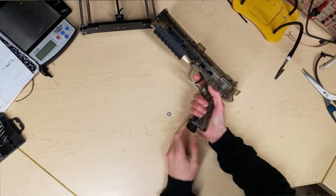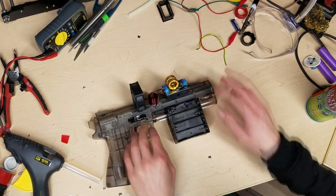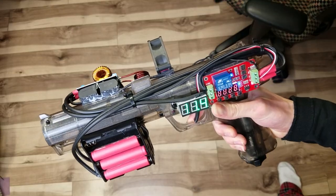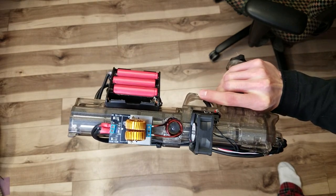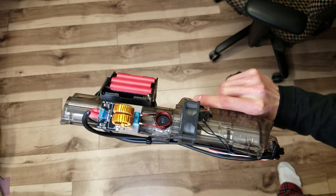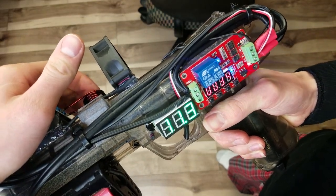I started with a basic paintball gun. I modified the loading area to fit the coil, and found a $20 induction coil circuit on Amazon. The induction coil is powered by a 12-volt relay circuit on a timer, which lets me program the coil kind of like a microwave. I attached a cooling fan as well — the induction coil tends to heat up from the current passing through it, so the fan helps keep the coil cool as well as the exterior of the ball. The whole thing is powered by six 18650 lithium cells, each running at about 4.2 volts when fully charged. I have two parallel sets of three cells in series, giving a maximum voltage of about 12.6 volts — perfect for this application. I also added a voltmeter on the side to track battery voltage.